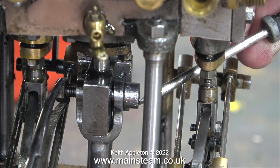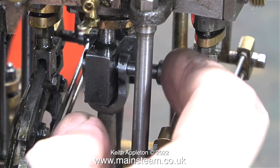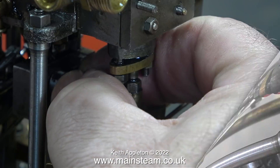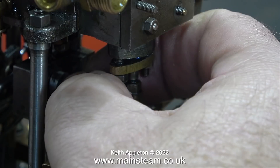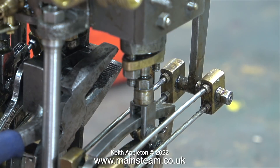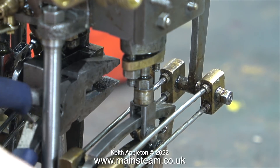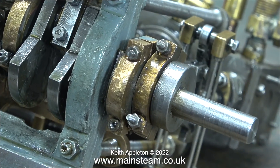This next part of the job — reassembling the crosshead pin — drove me mad. Try as I might using hand tools, I could not get the nut to engage on the thread of the pin. Thanks to either evolution or some supreme being, the design of my fingers proved far better than hand tools. I held the nut at the left hand side in a pair of pliers and rotated the pin with my finger, and in no time at all it engaged. Then I used a spanner at the left hand side and a pair of pliers at the right hand side.